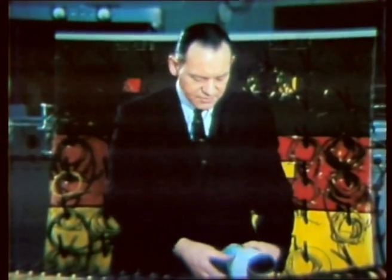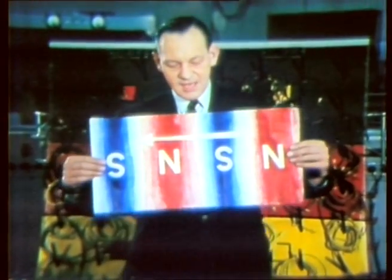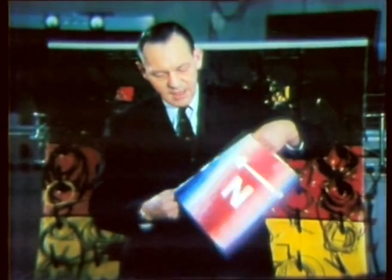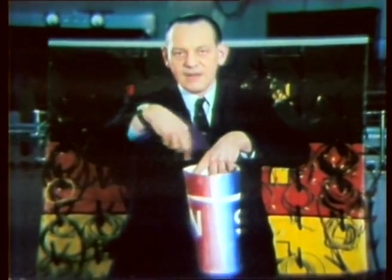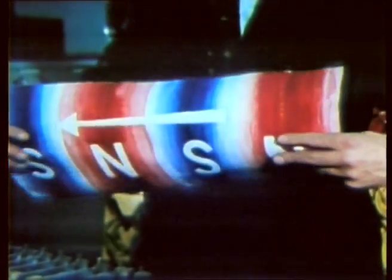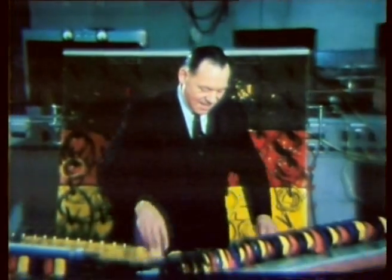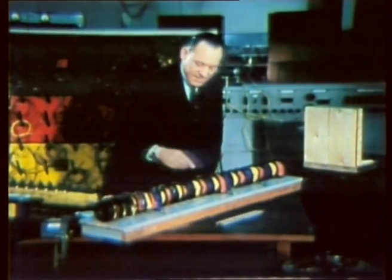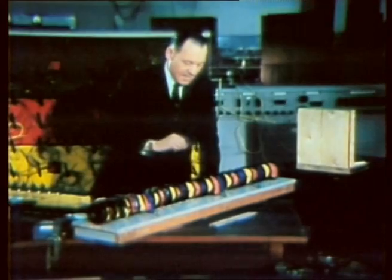You can illustrate the difference between a linear induction motor and an ordinary electric motor if you draw poles on a piece of paper. This, at the moment, represents a linear machine. But if I roll it up and make a cylinder, then the magnetic field moves round and round and we've made our conventional household motor. But suppose I were to roll up the paper in a different way — now the magnetic field travels along the axis of the cylinder. We have made an electromagnetic gun. In practice, it's very easy to construct one of these guns because all you need is a whole row of coils placed next to each other, and each coil is simply a coil of wire wrapped on a bobbin. The moving part is going to be a steel rod with a copper sleeve on the outside of it.